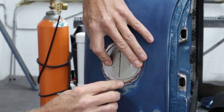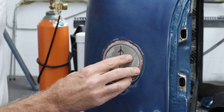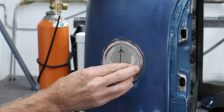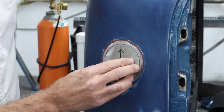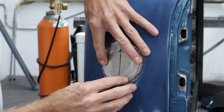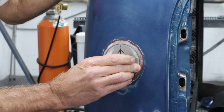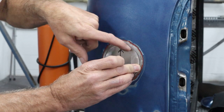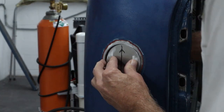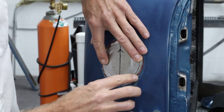It's fitting really nice - a little long here, could go down inside a little bit more, pops out a little there. The tedious part is just keep fitting and keep fitting. Feeling really good there. I just need to take a little bit off the length. I'll look from the inside out and see the light coming through to tell where it's touching, and that's where I need to grind some more.